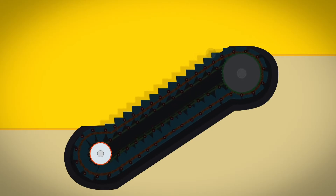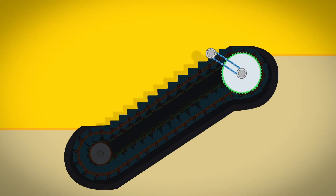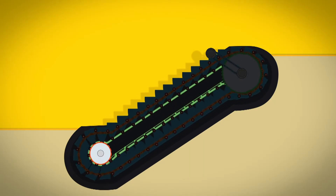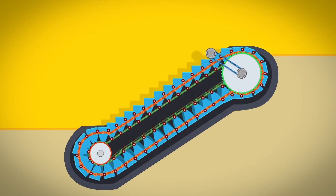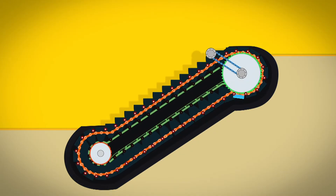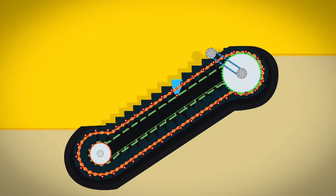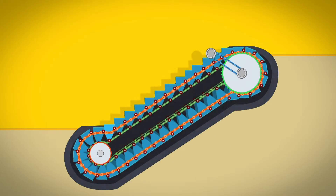The gears at the top of the escalator are connected to round bike chains — they look a bit like a bike chain. The gears at the bottom run along a track like a train. The gears have teeth on them and when they turn they pull the loop of stairs around with them. Each step has small wheels on it. When a step reaches the top, the chain pulls the wheels around the gear until the step is flat again. It stays flat until it gets all the way back to the bottom, ready to go round again.